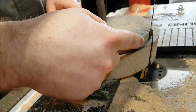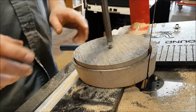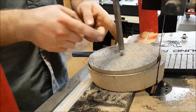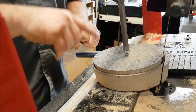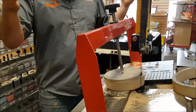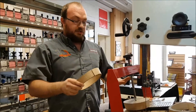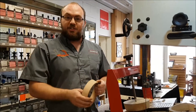Now the first cut I made, I had my pin set too far this direction of the blade - that means my spiral that I cut will get smaller and smaller. If I have this pin set too far on the other side of the blade, the spiral I'm going to make is going to get bigger and bigger. So that's how you can determine which direction you need to adjust that pin. We got this set up pretty good now, so we can go ahead and make as many bowl blanks whatever size I want. If you guys have any other questions, let me know. You can email me at info at stockroomsupply.com or comment on this video. Make sure you subscribe. Thanks for watching.